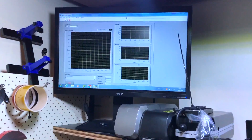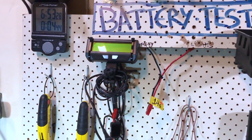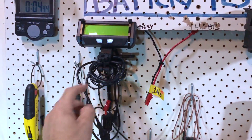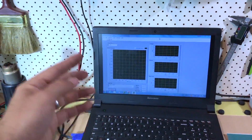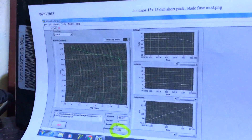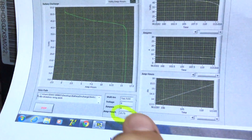So we've got the battery discharge test setup here. It's connected to the Cycle Analyst, and we pick up data from it via a little shunt. We're reading data from the process through a USB connector, and we get voltage sag. We get a nice graph — something like this — and then we do a screenshot and I make my little comment. This setup is old but it's still pumping.